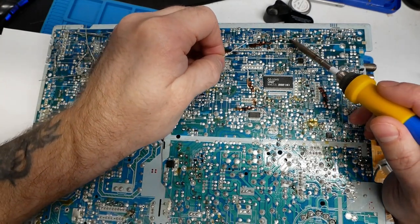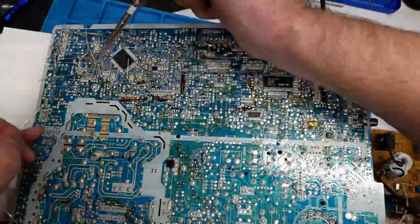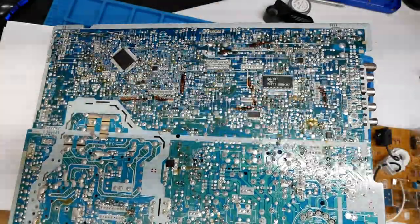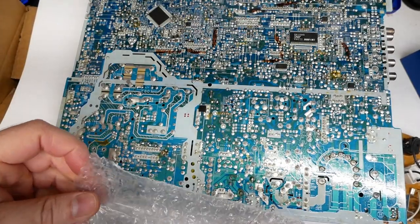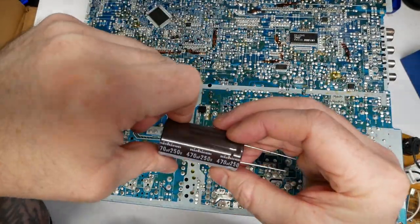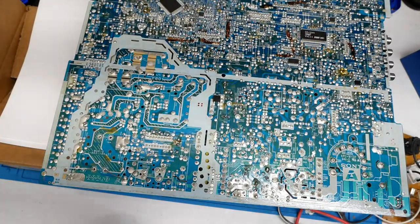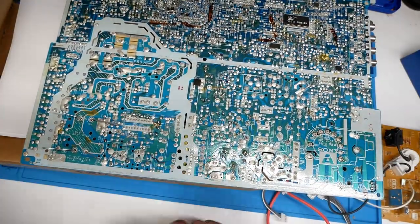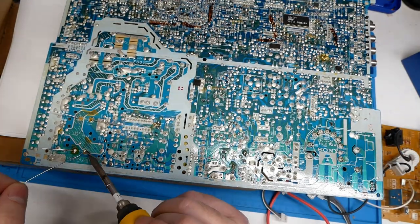Here I'm just finishing up that tuner section and hyper-driving through that audio section. There's that jungle chip up there. Last but not least are these two tall-boy power filter caps — I ended up pulling them off while I soldered all the others on and saved them for last. I bumped the heat up a tiny bit for these because the vias are reinforced and there's a lot of mass on those vias.